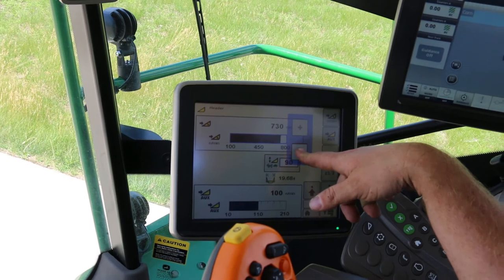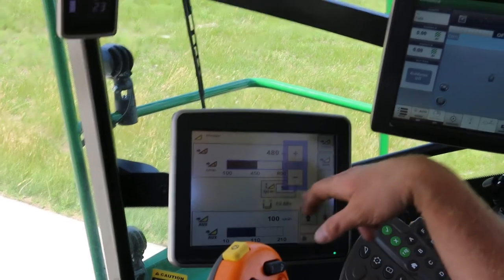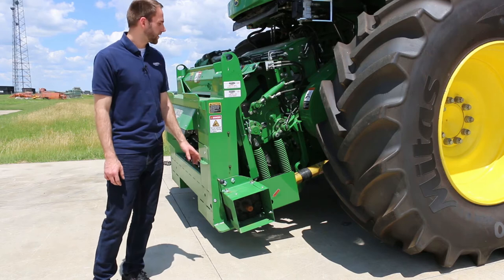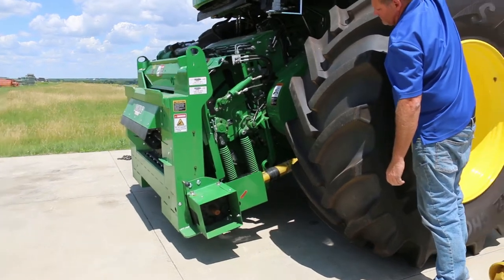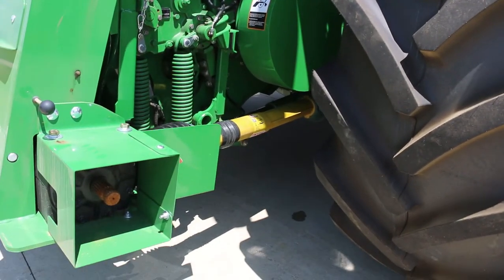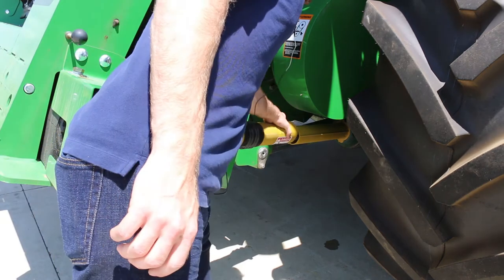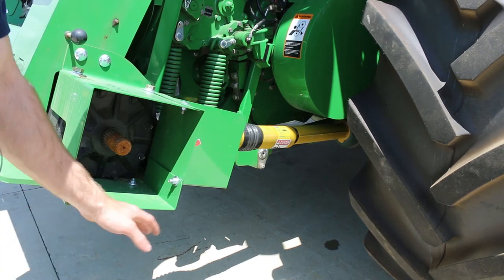Don't run at 480 RPM — it'll probably be a little too slow. For video purposes, we connected the standard gearbox or standard PTO that is on your 9000/8000 series cutters, and we're going to show you why you need to buy a PTO from us. When you raise it all the way, you can see this guard is fully extended, and if we put it back down it's just going to crush the guard — that's why we send you a new PTO.